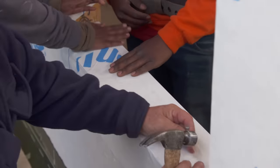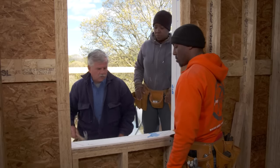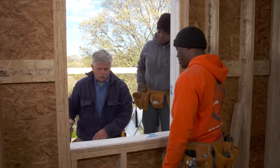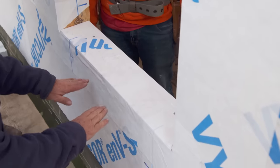We take a clapboard — it's a natural pitch, it's thicker on one side than the other. We put the thick side inside, and that puts a taper on that rough frame. We put it in like that and tack it, then pull the house wrap back up nice and tight. Now we can put a nail on that to hold it so it doesn't move around.